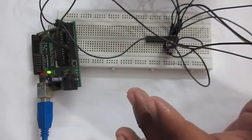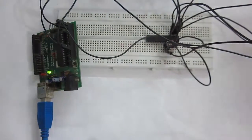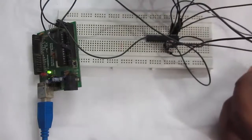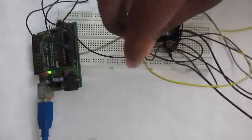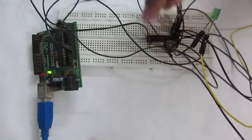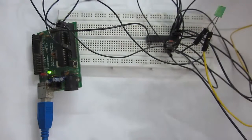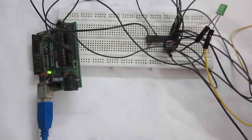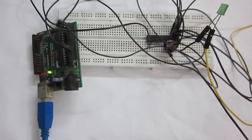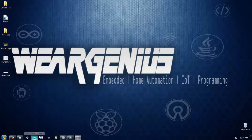Now let's check out how to make a particular pin of your MCP23017 a default output pin. To do that I'll connect one LED to a GPIO. Let's get back to the IDE and check out configuring the MCP23017 for input and output, driving some LEDs, and also providing some input to check the values on the Arduino node.